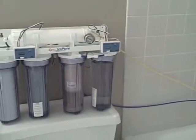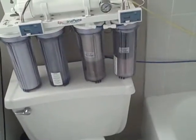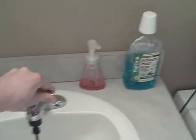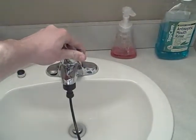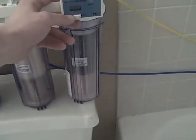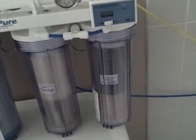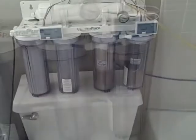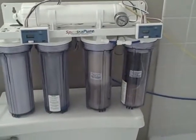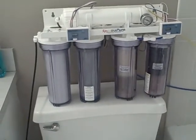So I'm going to take off the last canister and put the silica buster filter in. I've put the silica buster filter in, I'm going to turn the water back on, and I'm going to set the right-side TDS meter to 'out' and wait until it reads zero.